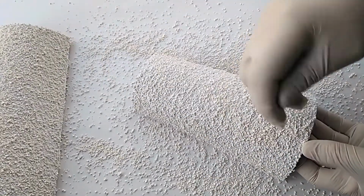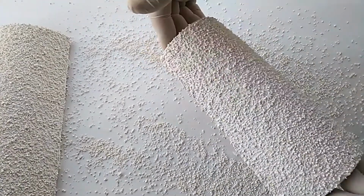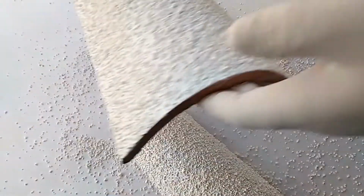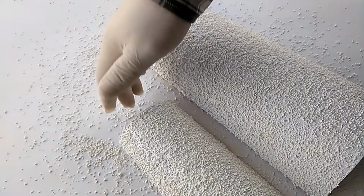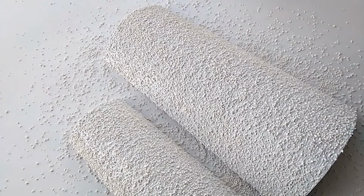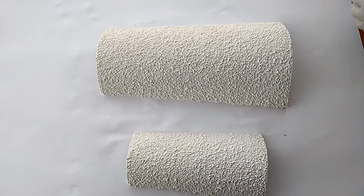For this we are going to prepare the liquid that we will use as a sealant. Basically the sealing liquid is prepared with white cement, water, bleaching powder and a surfactant or foaming agent. The bleaching powders and the foaming liquid are always supplied together with the technological grain. The preparation is simple: in a bucket, mix water with the bleaching powders, the foaming liquid and finally add the white cement. You have to beat it well, obtaining a rich foam.